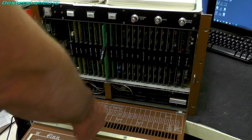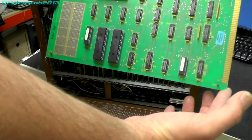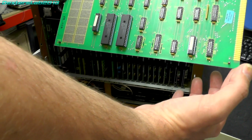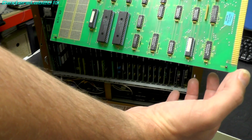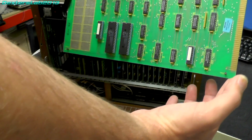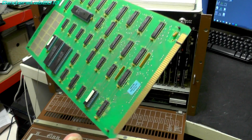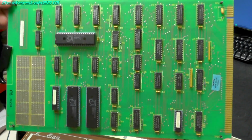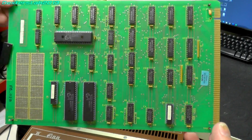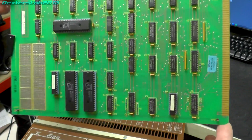And the next card is the brush processor card. 2 brush processors are used in the system, one for luminance and one for chrominance. They are identical and may be freely interchanged. This card takes the data from several sources: frame store, brush store, frame store extension, brush store extension and pressure, and combines them in various possible mathematical ways to produce an answer for feeding back to the frame store. So I think this is doing the maths on how to combine all the different things together to affect what you're doing in the actual picture store. So the pressure data from the tablet would come in, and this would affect how much adds to the original frame store and that kind of thing.